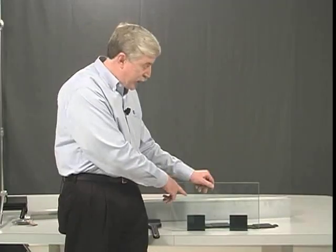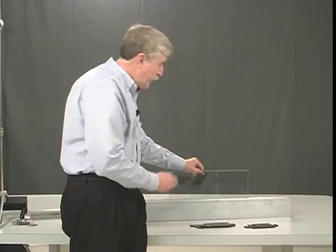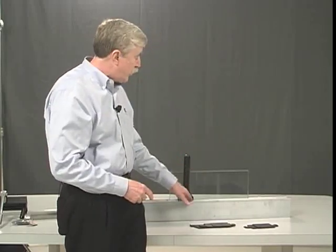Make sure you put your L pressure blocks on the back of the piece of laminated glass, then slide that into the correct base shoe. We've now added a new temporary holding tool to hold the glass in place — the black one is for laminated glass and the blue one is for monolithic glass. Both come with our installation tool kit.